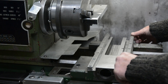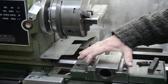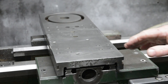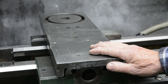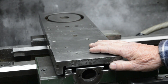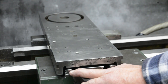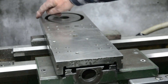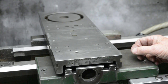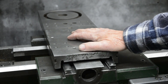The next step is to align this back rail to the front one. That should be easier because it would just be a question of measuring across at each end and then tightening the bolts. That's it for this video. We discussed briefly the alignment issues — they're extremely important but they'll take more than this video to cover, so that will be the subject of the next video. Not only the alignment of the rails we talked about here but also the alignment of this top surface. Come back next time to see how it progresses — that will be the more interesting video because I'll show various techniques for alignment that some people wouldn't have seen before.